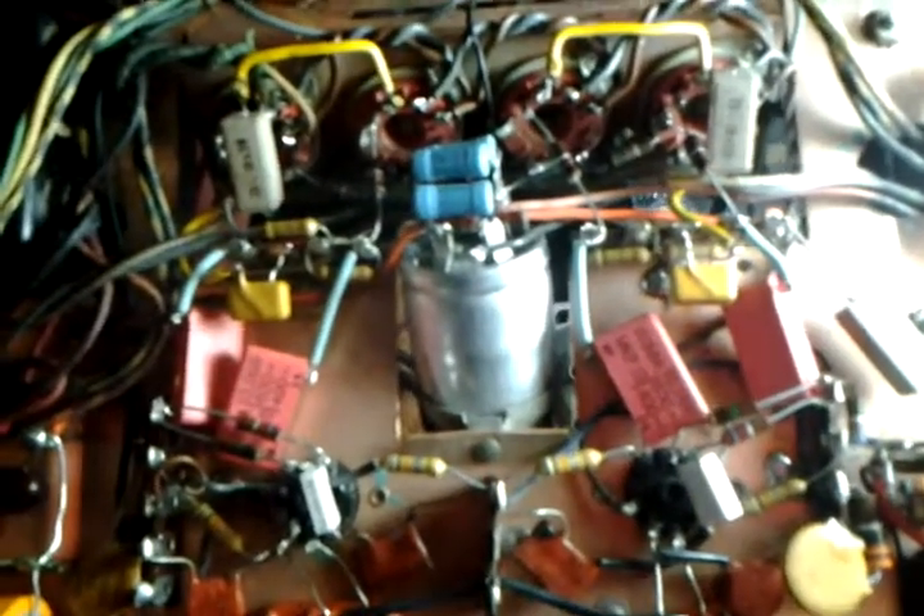In the power amp phase, if I touch here I get a hum on that side, and a hum on the other side. This is a mono phone so you can't hear the difference, but this is one side of the amp humming from the AC and the other side. From that area forward is what they call the power amp section, and here's the preamp — only one side of the preamps is working right now. There's a lot of static; that's normal — could be a bad tube, but more than likely it's corrosion on the tube pins and sockets.